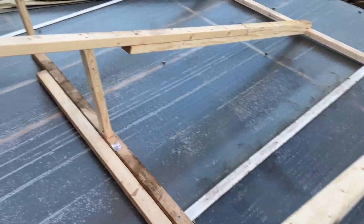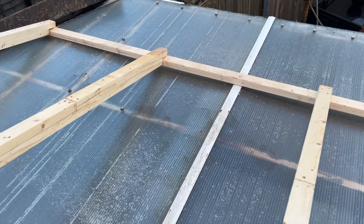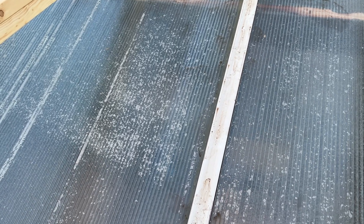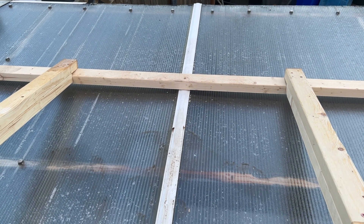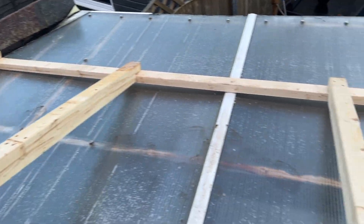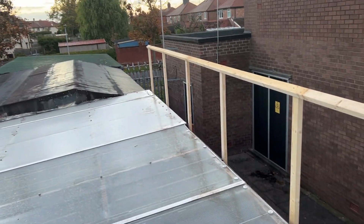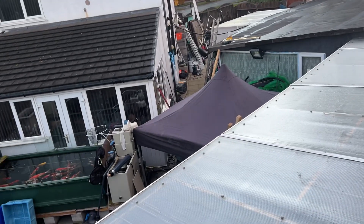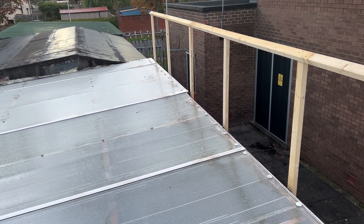So that's nice and solid now - across there, not moving. I'm going to put the strength bars inside as well in the middle. Pushing on this now - not moving at all. That's just a bit of wood to go across this section afterwards. So we've also screwed into the channel in the middle where you screw the aluminium strip - as people know, the polycarb goes up to it. Same again in there, screwed right in the middle of it all, nice and solid. We'll put some spaces in between it and fix that down and seal it up as well so we don't get water coming across. There's still plenty to get on with but it's coming dark and it's started peeing down.